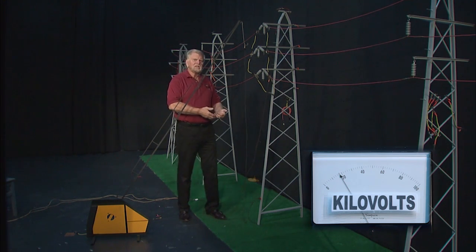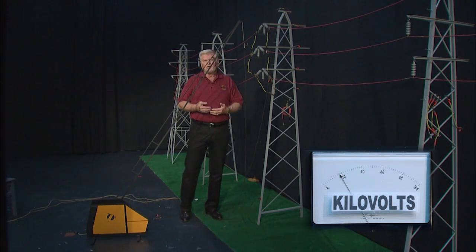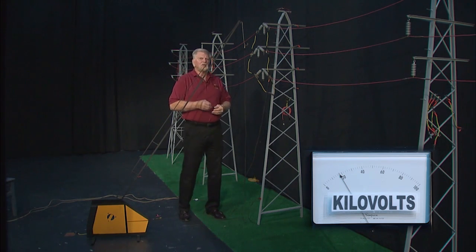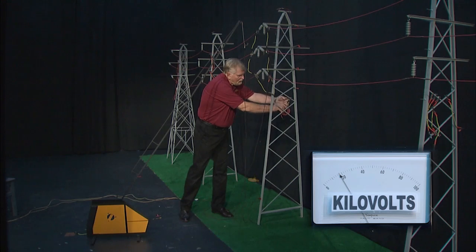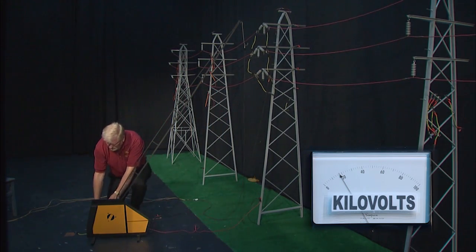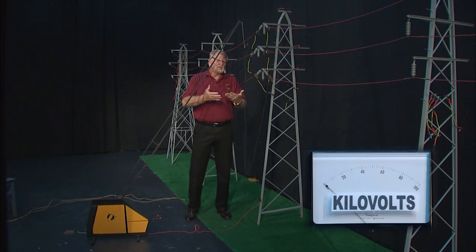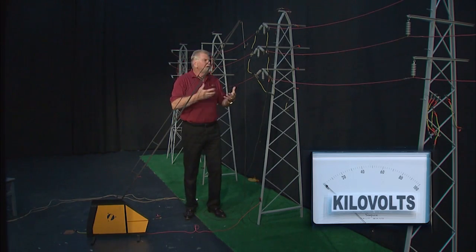In this case, the circuit experienced a single-phase energization. But I need to emphasize that this same hazard may exist due to either capacitive or inductive voltage. Whenever there are other parallel energized lines on the same structure or in the same right-of-way, the level of exposure may be different, but a hazardous difference of potential would still exist for a worker. I'm going to place a ground from the chassis of the mobile equipment to the common ground source at the structure that is used to ground the conductors. Instead of grounding this crane at a remote ground source, I will place a lead that goes from the ground source at the structure and ground this aerial crane so that the crane is grounded to the common work source grounds. As you can see on the meter, the hazard of difference of potential is now eliminated. The structure, the conductors, and the mobile equipment have all been brought to the same potential.